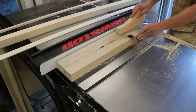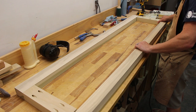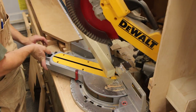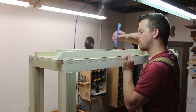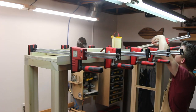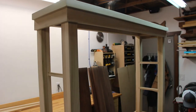On the top of the bookshelf, my wife wanted some nice chunky molding with a simple profile, so I made a solid frame and screwed that directly down into each of the four posts. I then cut out some nice square molding to put around the top edge, mitered the corners, and glued them in place. Below that I added some solid boards that kind of looked like craftsman style baseboards installed upside down.